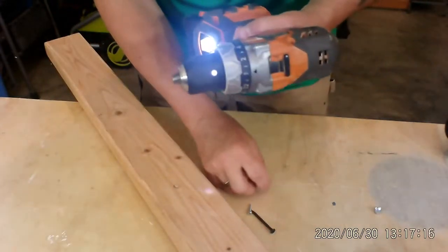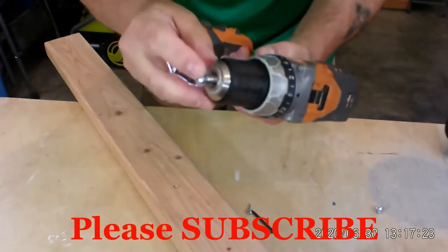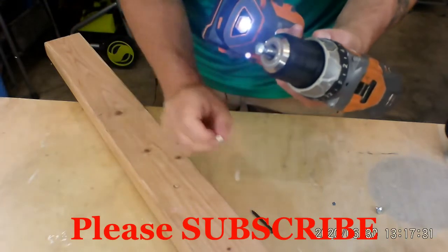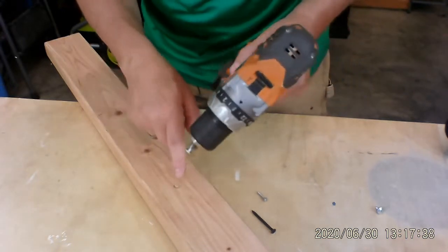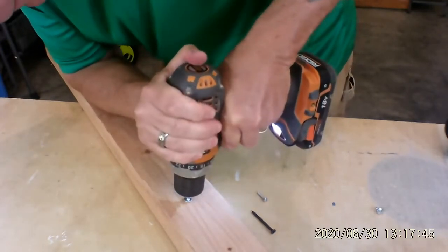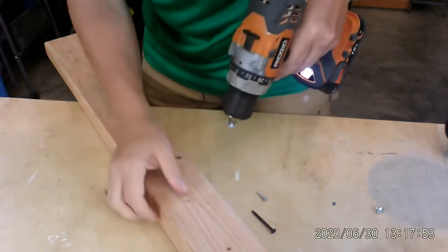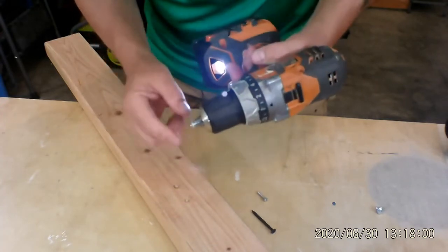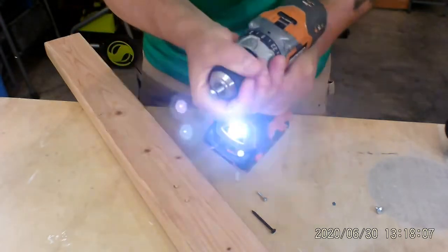Let's try another screw. We're going to try multiple ones just to see if any of them would work. This one has a little bit rounder of a head on it. I think what they're counting on is the roughness of the actual Phillips head itself, or the flathead — I've got one here that's a Phillips slash flathead — and see if that's what they're thinking is going to dig into the wood. The last one liked to travel around a little bit. All it's doing is creating a little bit of a crevice, but it's certainly not going to be big enough to actually make this flush with the top of the wood.